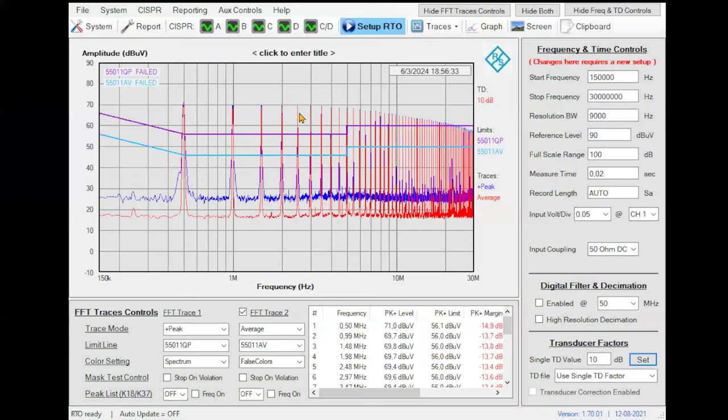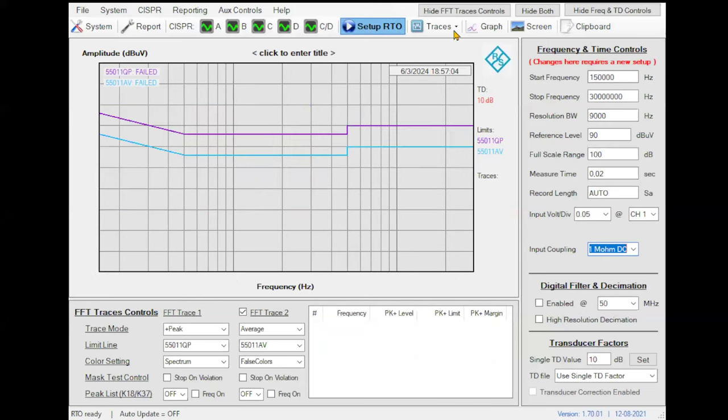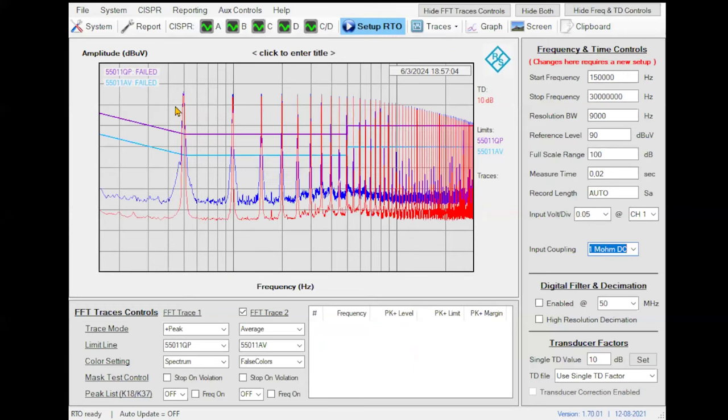And something that is important with the oscilloscope is to use the input coupling with 50 ohms. Because look at this, the peaks are going down, going down, going down. But if, by error, I configure the oscilloscope with 1 megohm, that is typical in many oscilloscopes that are not very high in bandwidth. The idea is that configuring the oscilloscope and recovering the measurements, you will see that they have the peaks going down.